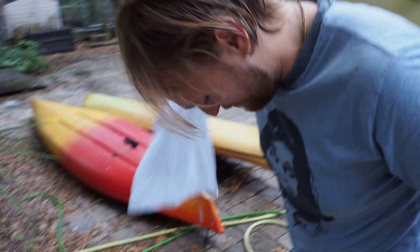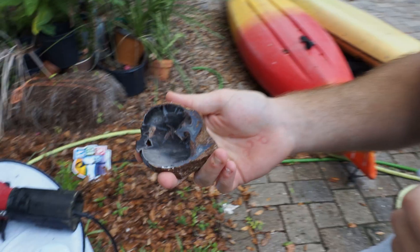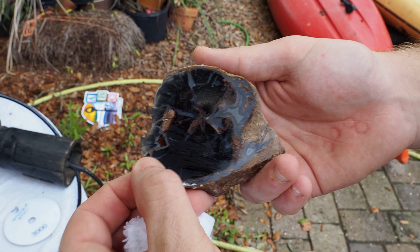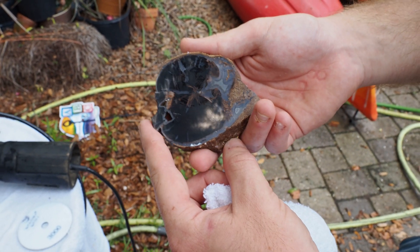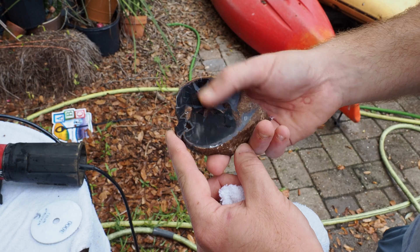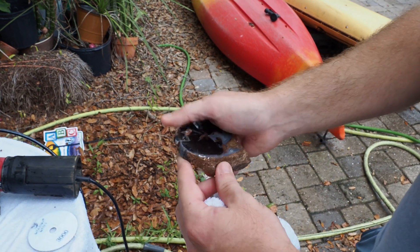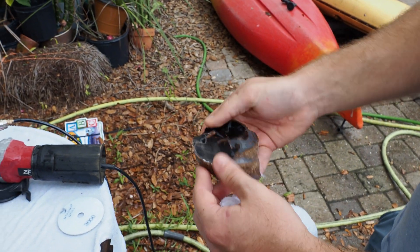Now we should have a really good mirror polish. It's a little cloudy but that's why we use the 3000 grit — it should be perfectly reflective after the 3000 grit. I don't see any obvious big circular scars anywhere, so the 800 grit got rid of the last of the 50 grit scratches.